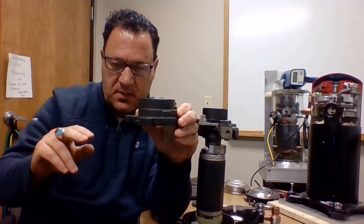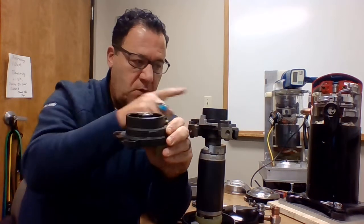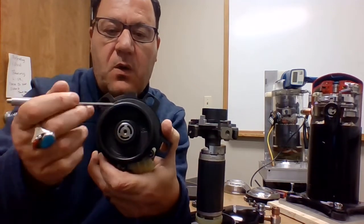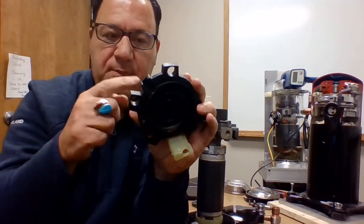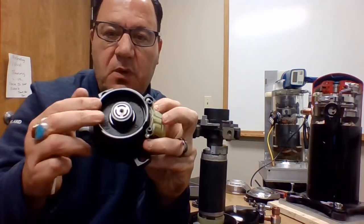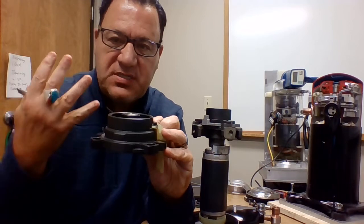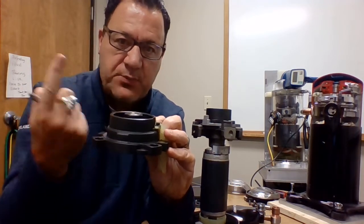It moves 1 millimeter. So on startup, the contactor pulls in and the orbiting scroll starts to move around. There is a bleed port in the medium cell of the fixed scroll, and as it gets to the medium cell, that bleed port allows this cavity at the top of the fixed scroll to be pressurized. It does two things. It pushes the fixed scroll down that 1 millimeter, engaging the tips of the orbiting scroll and the fixed scroll.